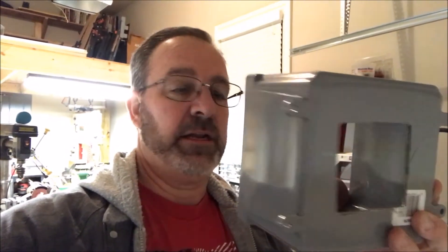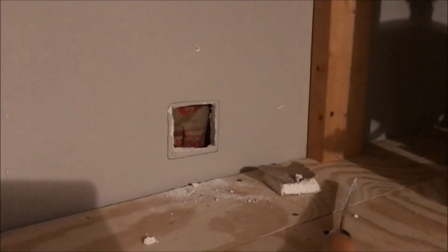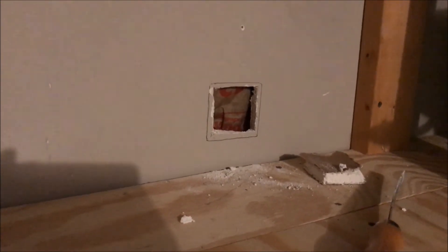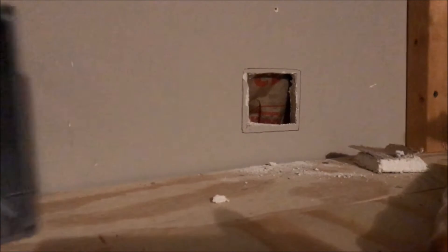I'm going to go ahead and cut a small hole in the wall. I've got to be really careful because I don't want to damage any wires throughout the house. I decided to cut the hole in the box first — that way I can position it on the wall, trace the hole with a pencil, and know exactly where to cut the wall and how large to make it. Here's my electrical box, and straight up above it there's the hole I cut in the wall. I cut it about a quarter to three-eighths of an inch smaller than it really needs to be, on purpose — I didn't want to cut a huge hole in the wall.